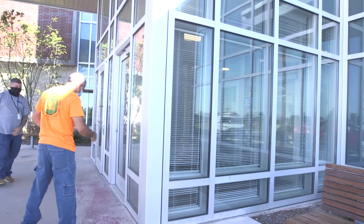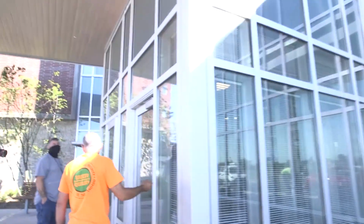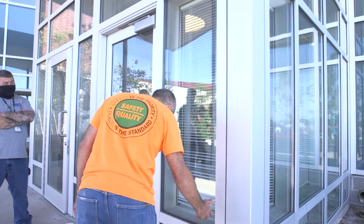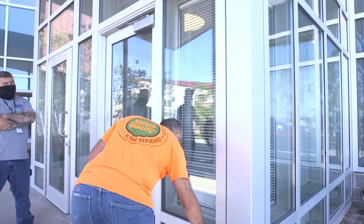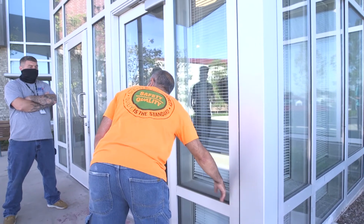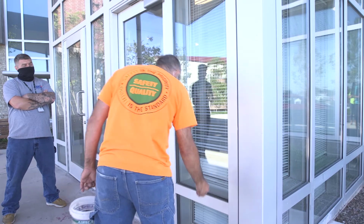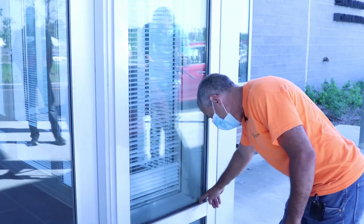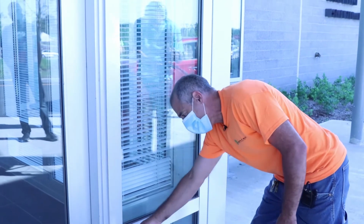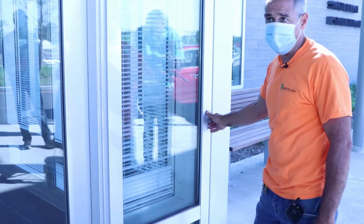Gentlemen, these are all insulated units. They're an inch thick, maybe a little better. The way these are replaced is that these caps have to be pried off with a crowbar, flat bar, glazing bar, any kind of thing that'll give you a little bit of leverage. You get under the rubber gasket, the caps pry off of a center raise. The same with these vertical caps.